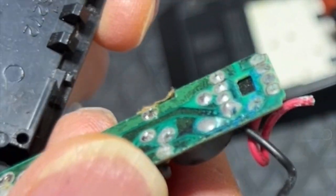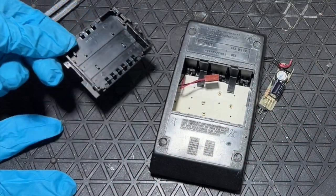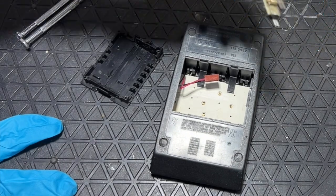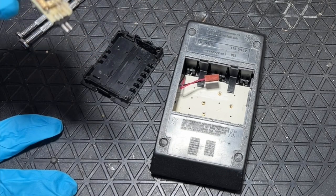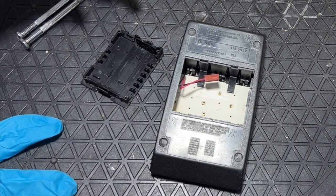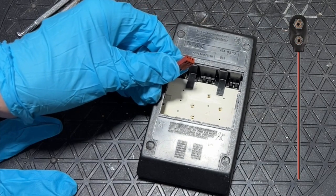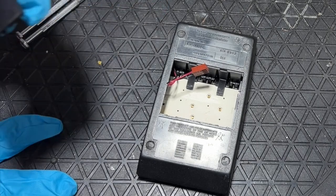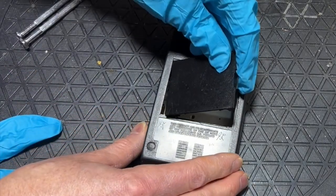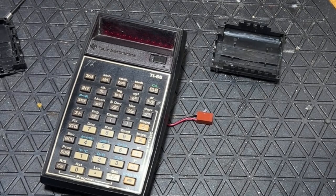It corroded off the end of that red wire. Fortunately, it didn't do too much damage to the printed circuit board. All the crusty corrosion has been removed from the plastic. I don't think it's worth putting in two batteries just to go from about 3 volts to 9 volts through this converter. I think it would be easier to put in a 9-volt battery snap onto this, observing polarity of course, and then use this as the bottom of the calculator, because it still holds together nicely. Maybe I should test the calculator first on 9 volts, just to make sure it functions, because there may be something wrong with the calculator.